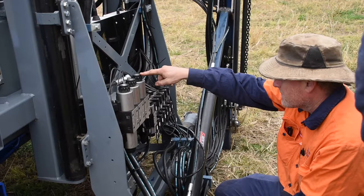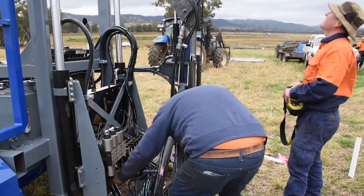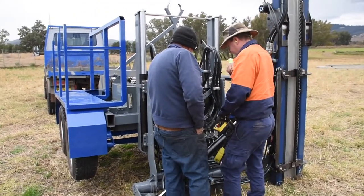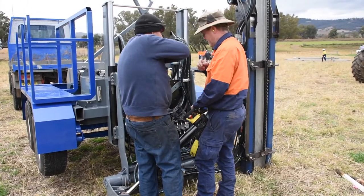So unfortunately, the driver didn't work. We had a few spectators looking on, and I guess we gave it a chance that it would go first time without any prior testing, but shit happens. So all we had to do in the end was swap the in and out on the hydraulic circuit, and then she went like a dream.